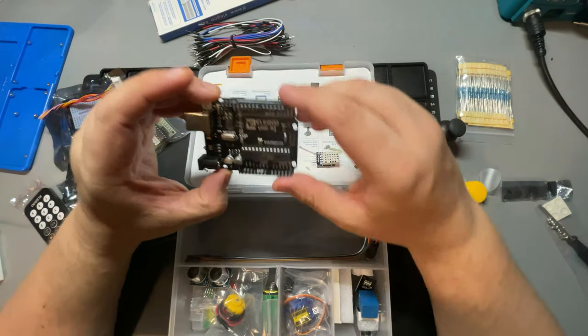So then we want to put the resistor into there and into, say, here. So that now is effectively transferring positive into this row here. So then this is the longest leg, so that was positive as well. So that would go there. And then between there and negative, which is over there. Oh my goodness. I see there's probably a way of doing better planning. So I think that's how it's supposed to be.